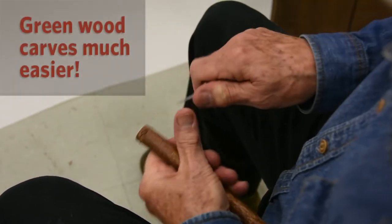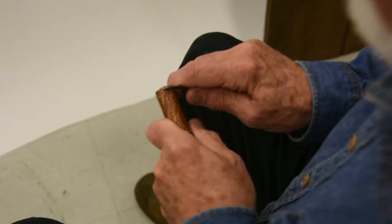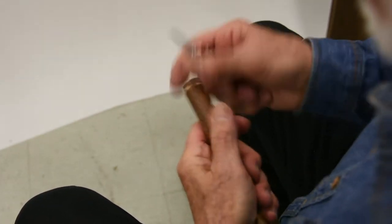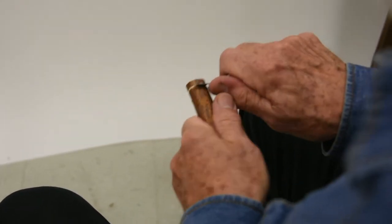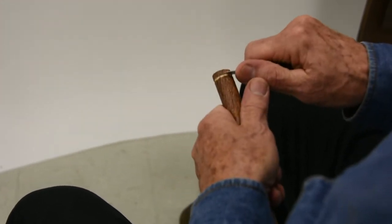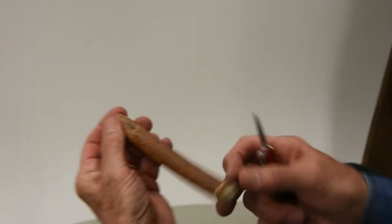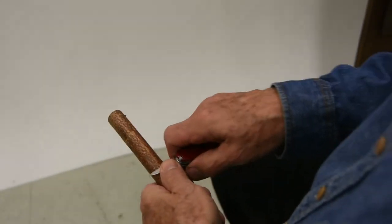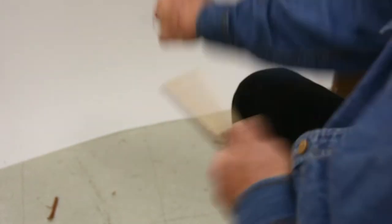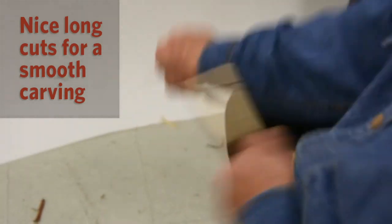When you're working on a piece of wood like this, if you get a green one it'll work a lot better. Now I'm going to try to get this little groove cleaned out — little V cuts, in from one side and down from the other. Now let's make the handle. This will be the handle, and I'm going to make the blade from about here down. Nice long cuts — don't cut in short choppy strokes. Nice long cuts; try to go pretty much the whole length.